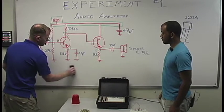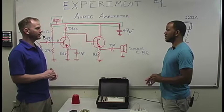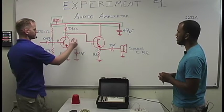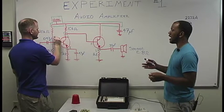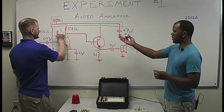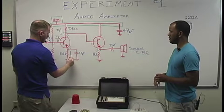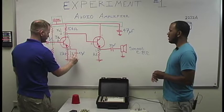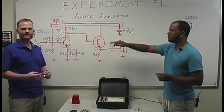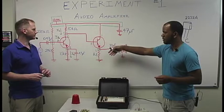Of course. And then we come to your currents. Your currents are going to be different. Exactly. In fact, Aspen, if you want to run them through their currents real quick. Yeah, definitely. So current at your base, if we're starting at the base of our BJT, we'll identify as I sub B, current at the base. It's just going to be pretty small. And of course our current through our collector, the I sub C, and then through the emitter is I sub E, as Brandon finds other places to write it. There you go. And with these three currents, you definitely are going to want certain currents to be greater in value than other currents, so that, again, we ultimately have our final current going downward through our emitter, right?